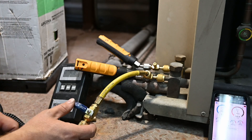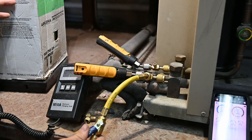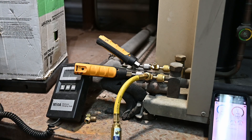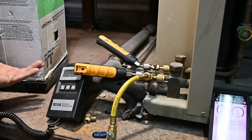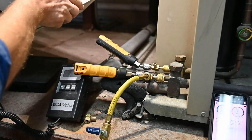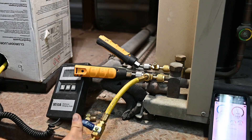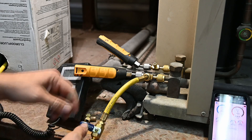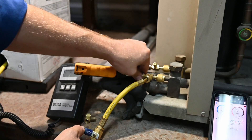In this system we're going to add refrigerant into the suction side. This is set up as a pure refrigerant — R22 — so I can add it in straight vapor, unrestricted, because it's vapor going into the vapor side. However, if I wanted to add liquid refrigerant — in other words, turn the tank upside down — I would have to add it in short little bursts. This would allow the refrigerant to boil or change state into vapor before it gets into the compressor.